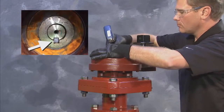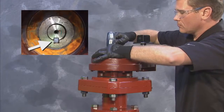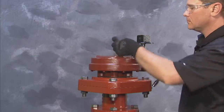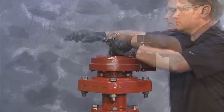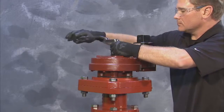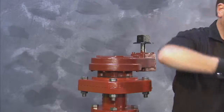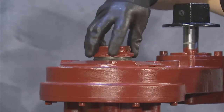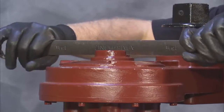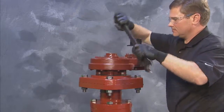Insert the key and lightly tap it with a rubber mallet until it is flush with the top of the valve stem. Attach and tighten the washer and stem screw, and rotate the gearing op nut in either direction to confirm that the gear is moving the valve stem. Finally, reinstall the pipe plug cap and tighten to complete your large valve gear spur or bevel gear changeout.